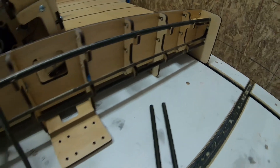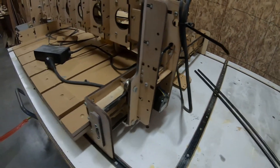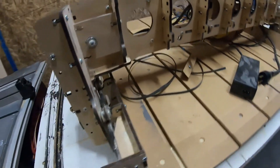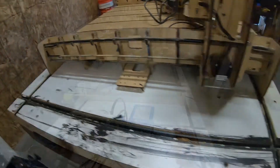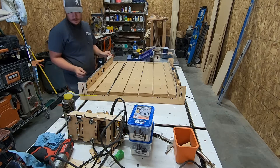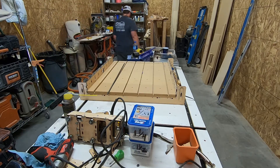Here I was just trying to show some of the dust that had collected on these rails. You have to clean these pretty often — almost every cut — to make sure that those wheels didn't get jammed up or locked up. You can see how dirty they are. The only fix to this is just throwing a vacuum setup on it. I made a very rudimentary simple one and it's actually worked out really great, so I'll show that in another video.